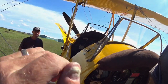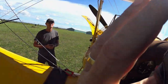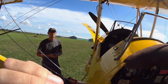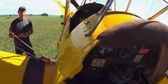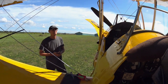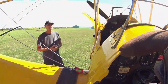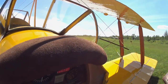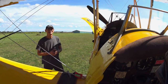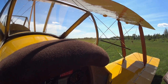We got 1,950 RPM on the initial takeoff run, which is exactly what you'd expect, and then I had to pull it back as soon as I leveled off a little bit. Your airspeed indicator does not work at all — zero. I was just using 70 for everything: 70 for climb, 70 for approach. I stayed very high there because I wasn't sure, and then I turned around just this side of the taxiway. I wanted some energy in the bank on that one. I'd kind of forgotten how far these things glide — a little better than I thought. It looked nice coming in — a nice landing.